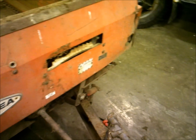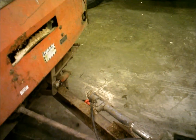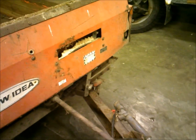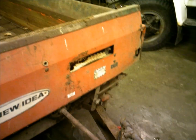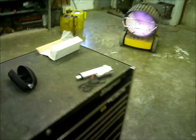So I put the cylinder on here last year, a tiny little cylinder. One-way deal because it's got a spring that pulls it back that way. And I've got that orifice down and everything, but you touch that lever and it's just over real quick. So I'm going to take it off and redo the bracket a little bit. And I bought this little linear actuator I'm going to put on here. I think this will ease into it a lot better and do more what I'm looking for.